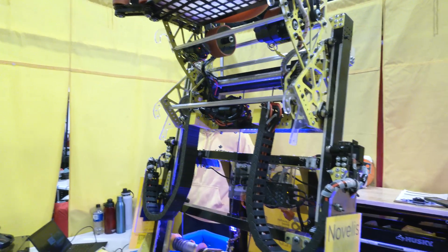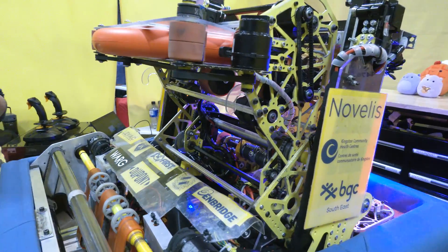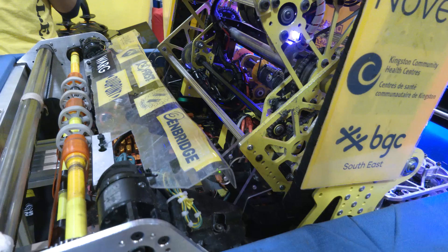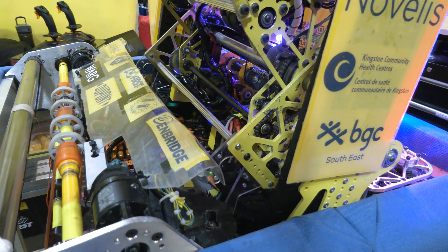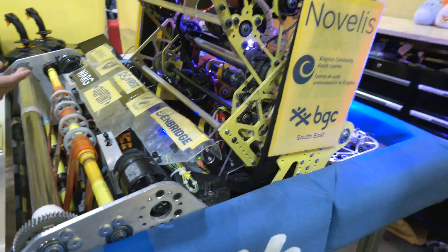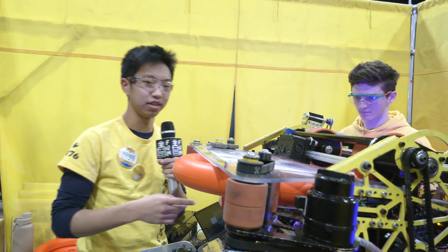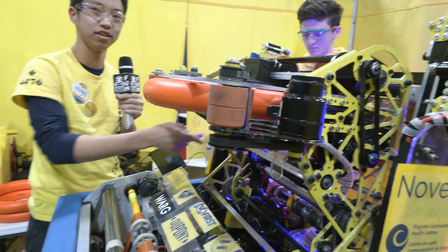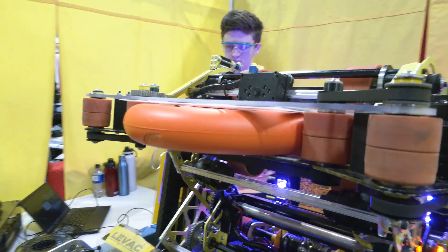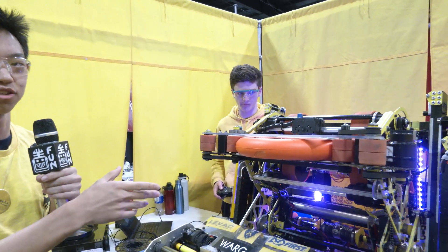Looking at your different states, how does climbing integrate with how this elevator works? It seems like a really simple, elegant solution. We just have the hooks directly on the shooter. Originally we were planning to have them on the carriage, but we found that the geometry didn't pan out the way we expected in SolidWorks, so we improvised and put them on the shooter. These have been really good because the driver doesn't have to try to line up that much — the curves on the shooter plate just guide the chain into it. The shooter pivot also allows us to use it to stabilize our climb and make it even faster.